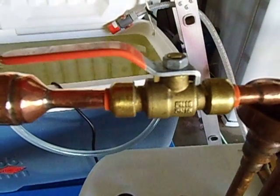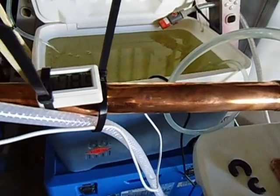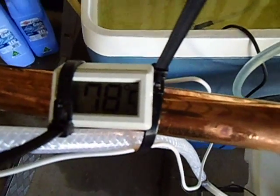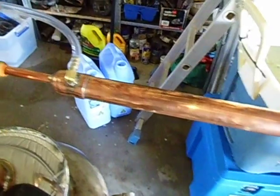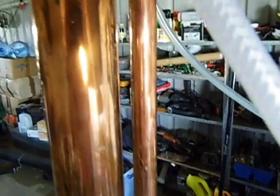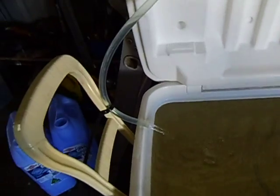That is just a shuttle tap — a shuttle valve, whatever you want to call it. Horizontal condenser. The vapors come off the column at 78 degrees, catching nice and steady. There is the condenser, all of the pipe connected up to the vertical one, running up. Outlet is going out there, and it just returns back into the esky, just like that.